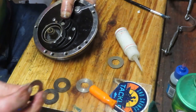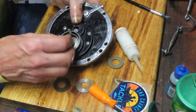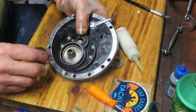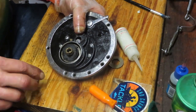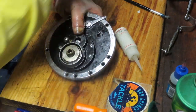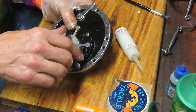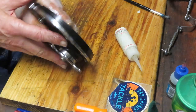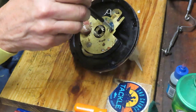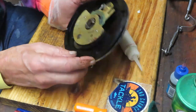Some of them stayed in there. Let's have the keyed washer, then go find that bell washer — that's the one with the curve. I'm going to hold all of those in. There we go — looks a whole lot better. The only thing that needs attention now is a little bit of grease onto the shoulders here, which we couldn't get before when we were loading that in. That's your completed side plate.